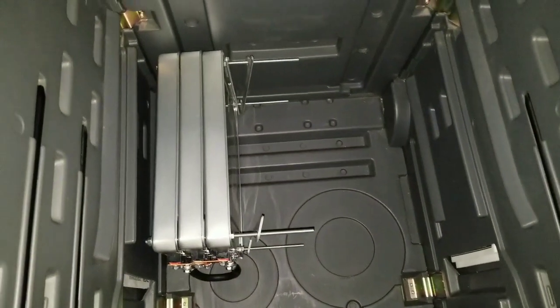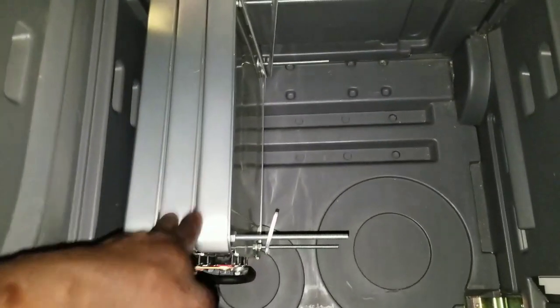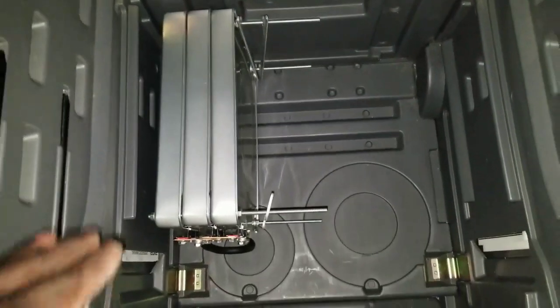Look how the batteries lay inside it — really cool. Filled up this one old rack. It's enough for 12 volts. Even if it's 8 or 12 batteries, I'm gonna get 10 batteries. I can parallel all five in parallel to build up more amps at 7.8 to 8.2 volts, then series them and I've got my 12-volt system. So it's gonna stay on this level right here. Then I can put a board right here and mount the inverter on top here. Get all the other cool stuff, and get a fan up here somewhere to extract the warm air out, while I have the openings underneath so it can breathe better.